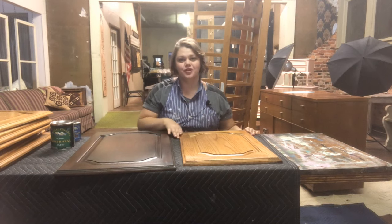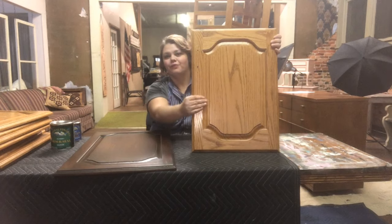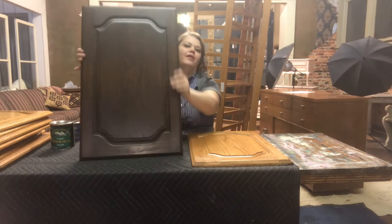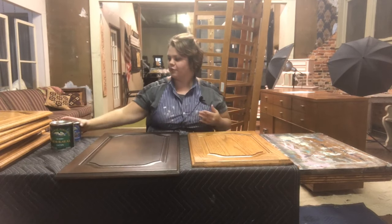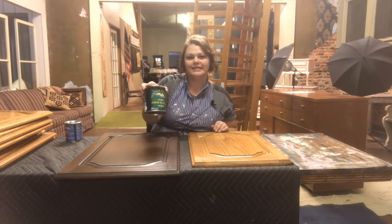Be sure to subscribe to the YouTube channel and you can find us online at originallywornonline.com and on Facebook and Instagram. I'm going to demonstrate this cabinet restaining technique — this is the original kind of golden oak, honey oak cabinet, and it's going to turn out like this, which is an antique walnut type of color. For this process I'm going to be using General Finishes gel stain in antique walnut, and then we're going to be top coating it with General Finishes Armor Seal in satin.